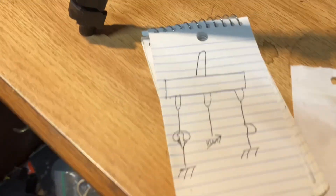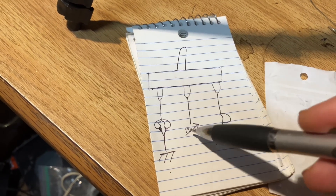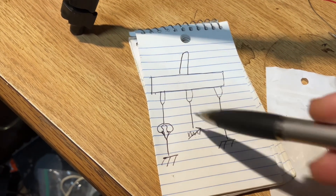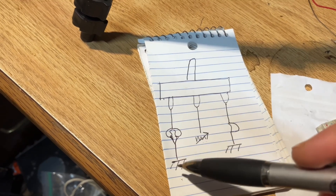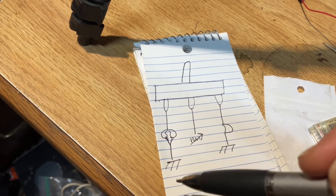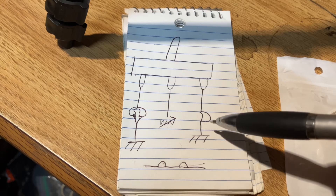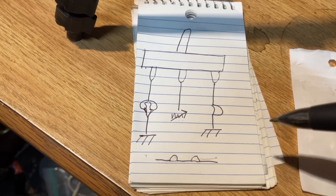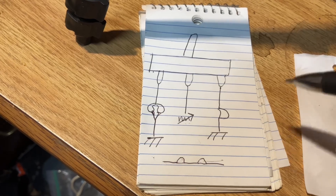What you want to do is hook it in series, like this. Here's the capacitor connected really close to ground, and up here that connects to our switch. If you wanted to add more capacitance, you could add two in parallel — that connects to ground, same as this — and that would give you extra noise reduction. And by the way, if people sound too muffled when you add this capacitor, just add two in series: that'll lower the capacitance, it'll still stop some of the noise, but it won't eat into audio frequencies quite as much.